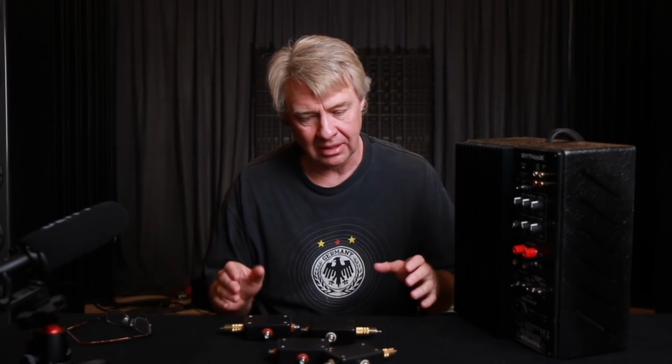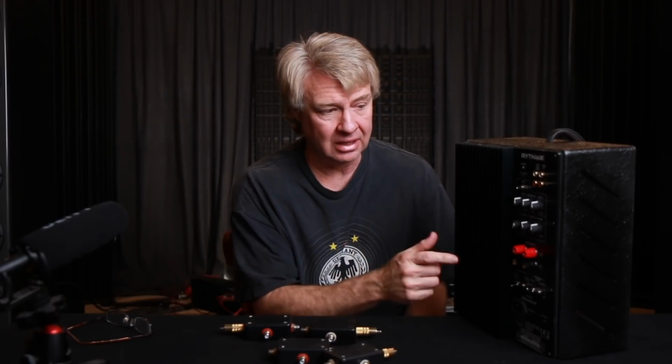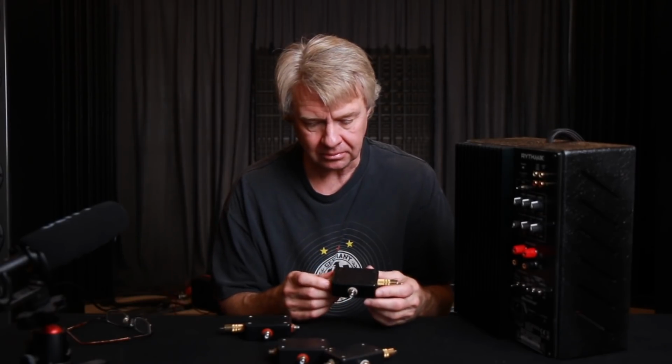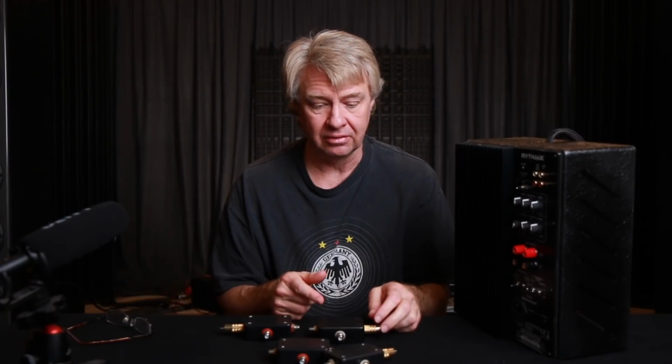A lot of guys are trying to use DSP systems to control all that stuff. They're trying to use miniDSP and all kinds of crazy stuff, Dirac, which is actually a pretty good one, to control that bottom end. Those can be effective, but sometimes you don't want all that in your signal path. You can keep that stuff out of your signal path and just handle it on the analog output much easier and without degrading the signal. Something like this as an inline filter isn't going to degrade the signal to your main speakers. This is the way to filter that stuff off. Granted, it's a low order filter, but it works great.